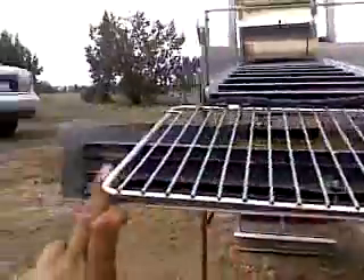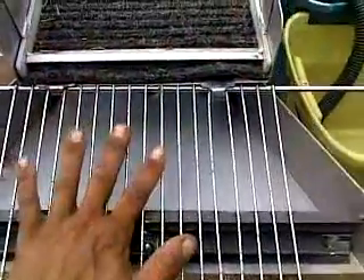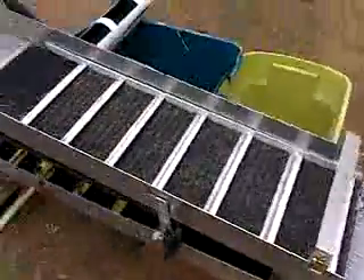You can see the grizzly here is a grate from an oven. On the sluice box flare, so that material wouldn't blow off the back side, I put a piece of window frame and bolted that on right there — it creates a back clip. That way you don't really have to classify with this system because it's triple stage with the grizzly. You can really just put full unscreened material through here and wash your rocks a bit.